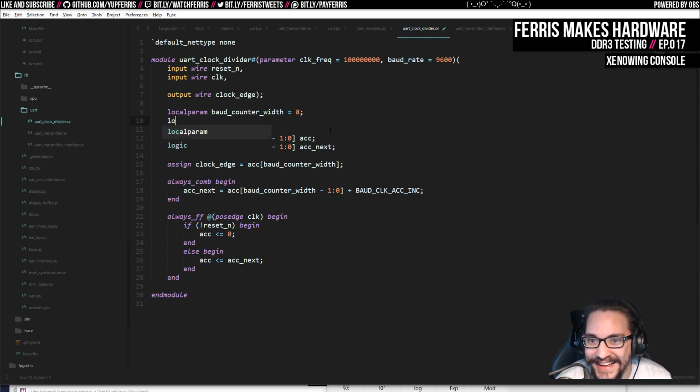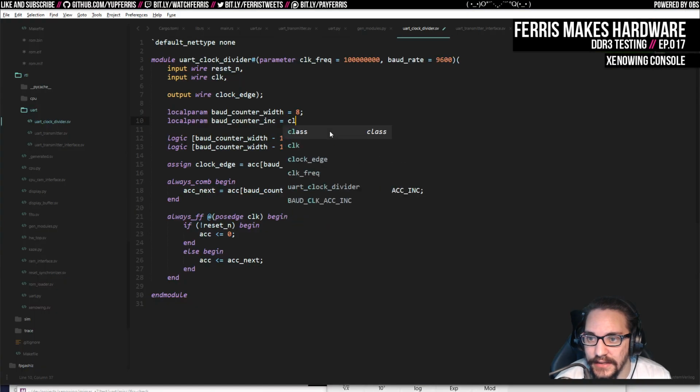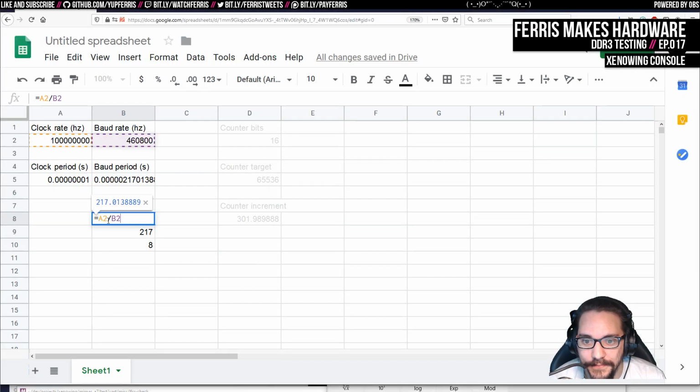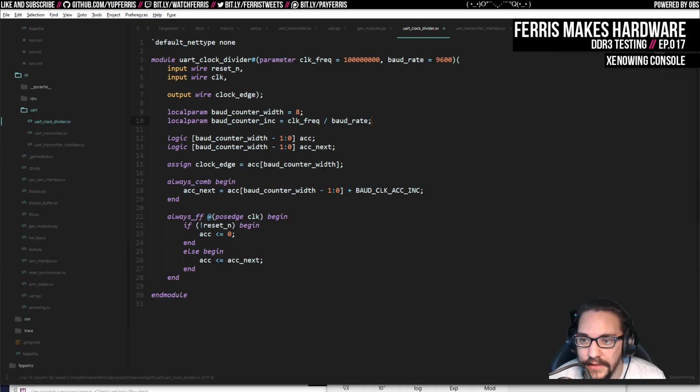Good call. Local param baud counter inc. And that's just going to be, like you guys say, clock frequency divided by the baud rate. That is exactly what it is, isn't it? So then this becomes easy. The next one is always going to be ac plus inc.